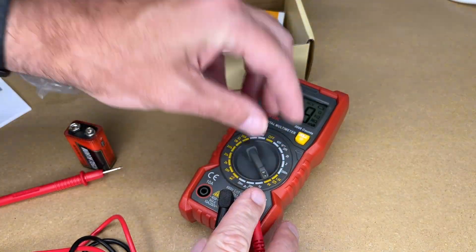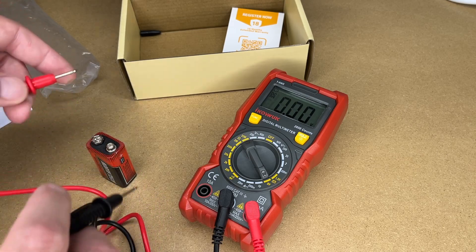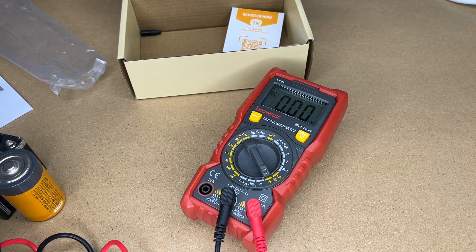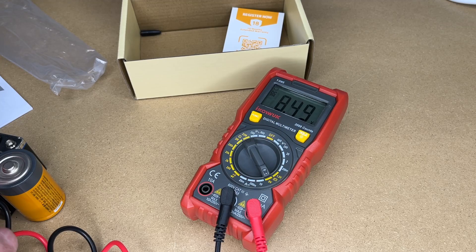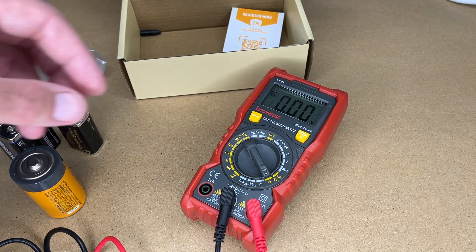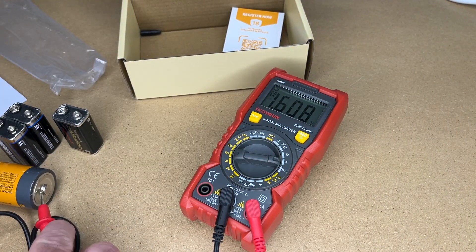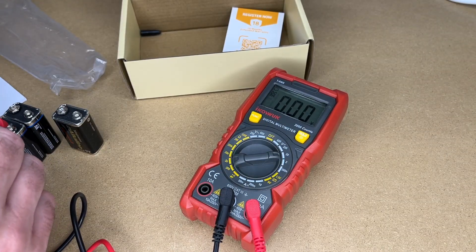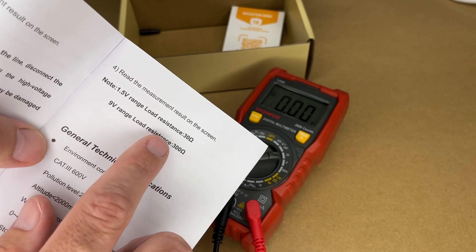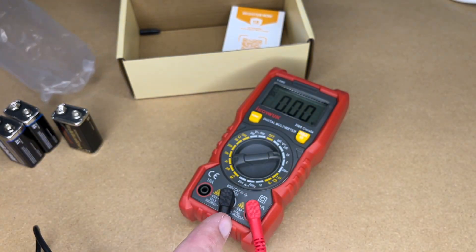I have a battery here — let's test a 9 volt battery. The smaller terminal is positive. I'm not getting anything on the 9 volt setting there. Switching to the 1.5 volt setting, we got 1.54. I have a bunch of 9 volt batteries — let's try them all. One has 2.75 volts, another 8.4 volts, and another 5.55 volts. Let's also measure DC voltage — on the 2 volt range the AA battery shows 1.608, and on the 20 volt range the 9 volts show 4.88, 6.56, and 9.09. On the battery tester, the 1.5V range has a 30 ohm load resistance and the 9V range has a 300 ohm load resistance, so it puts an actual load on the battery during the test.